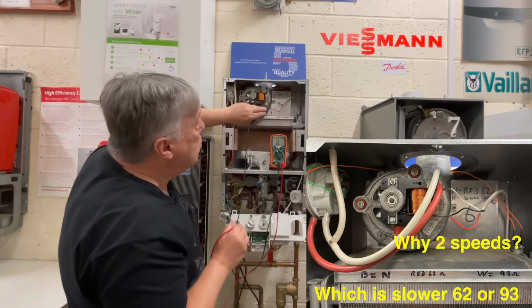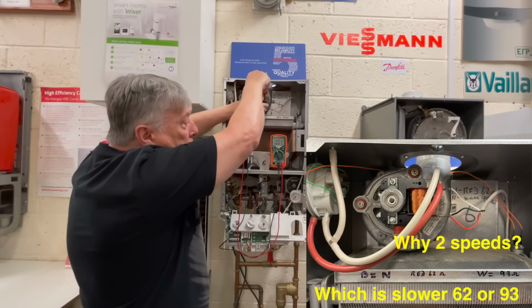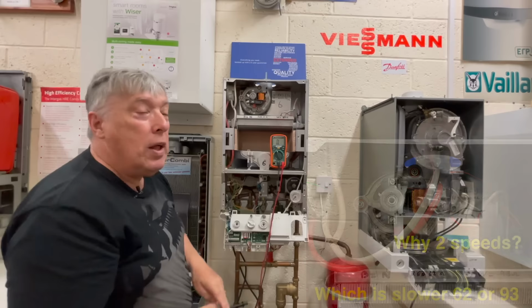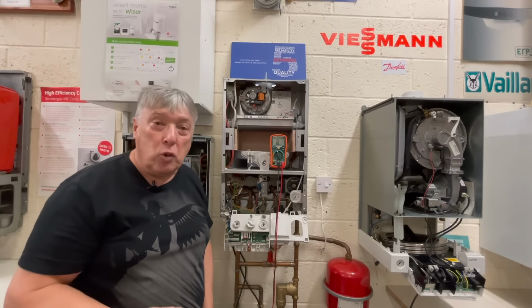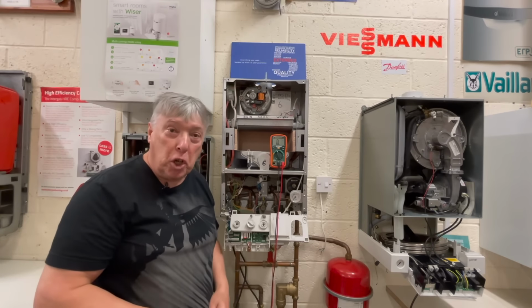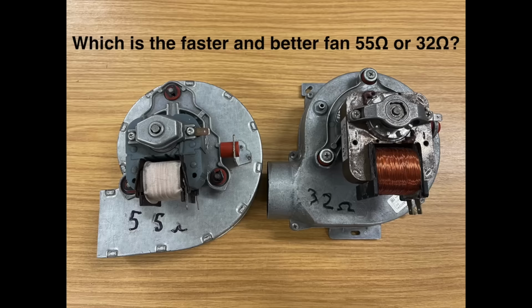So again, we'll put it on the neutral, put it on the top, press hard reasonably, and then we can see here, yes, it's mid-90s, so therefore that's going to be the slow speed when the gas is on low pressure. And that's how we do a double one. Very easy.